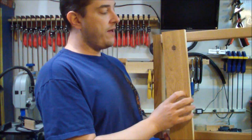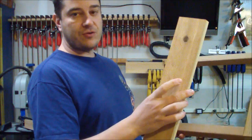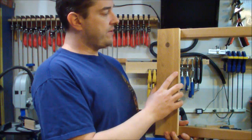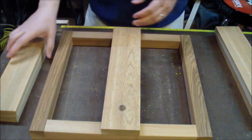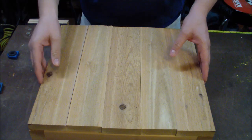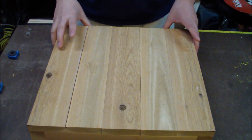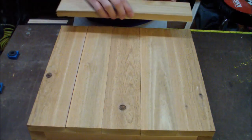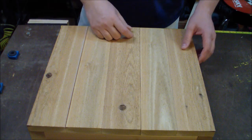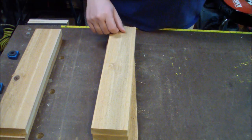The next decision is whether you want the more finished, sanded side of your cedar facing out or the more rough side. For outdoor projects, I definitely like the outside rough look — that's just a preference on my part. Here's my frame and what it'll ultimately look like on the outside. I cut the width of two boards about 3/16 of an inch so they'd fit just right. Then I'll put a frame across the top and sides and bottom to make it look a bit nicer. To start, I'm going to drill pilot holes for all my boards and then start assembling.